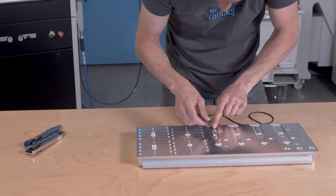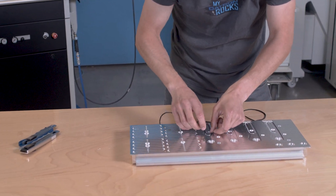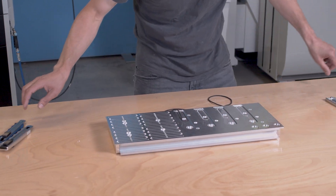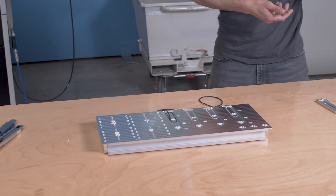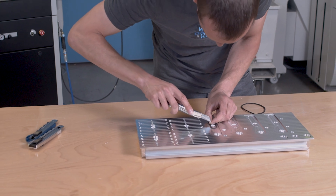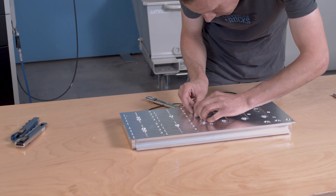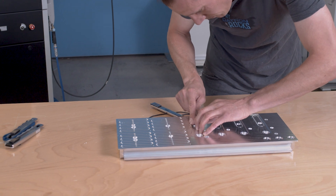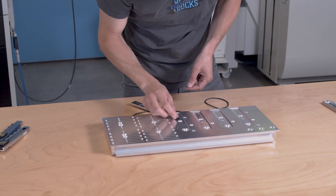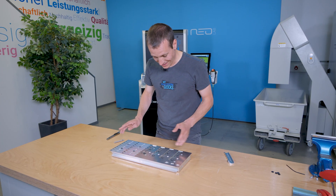I put it in without any stress, and then cut it off slightly longer so that the start and the end have a connection to each other. This is how the gasket should sit in, and also the little rubber plugs for the vacuum to go through, and then we're almost ready to mill.